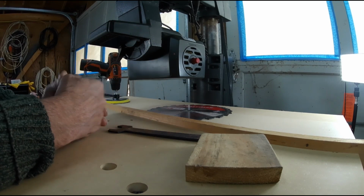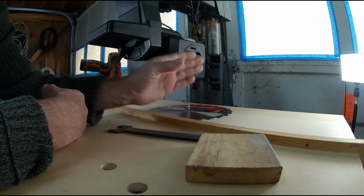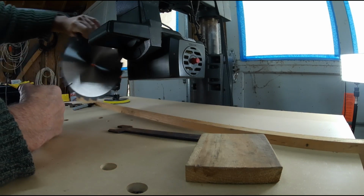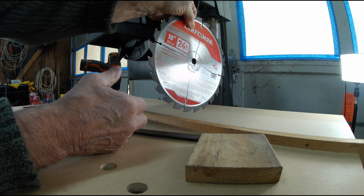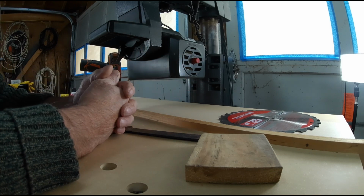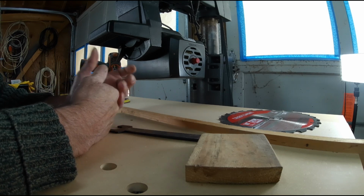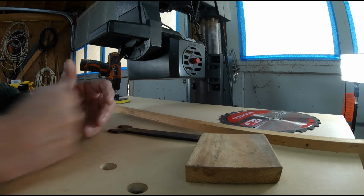Well, I do because I use both ends of this. I could not put a cutter that belongs in this side over in this side because it will not work. Certain cutters do because I'd be able to switch it. A dado, if I put a dado here, and if I was to put it on this side, I could flip the dado for it to work. But some other cutters, you cannot do that. I mean, I use the router on this side, and those bits are for right turn. They have to go clockwise. I will not be able to put them on the other side if I have some kind of attachment. Certain cutters that I have on this side, I cannot use over here because the rotation is different. I think I should mention that.